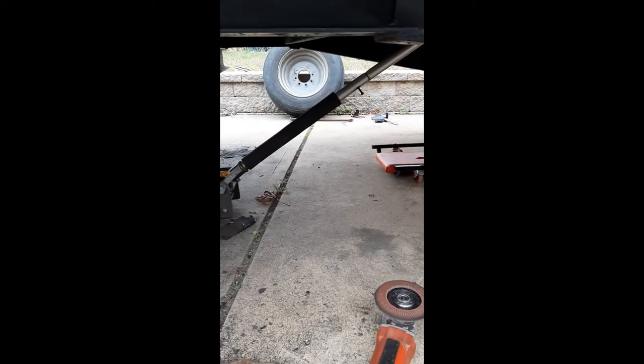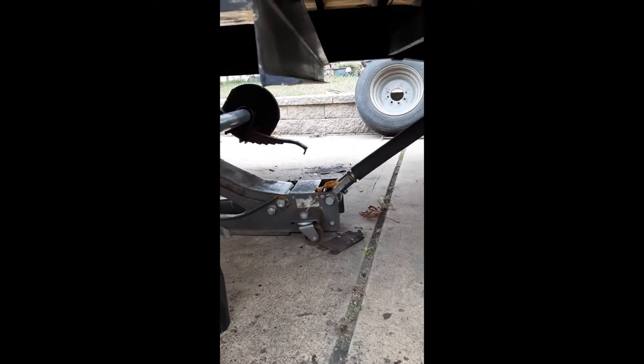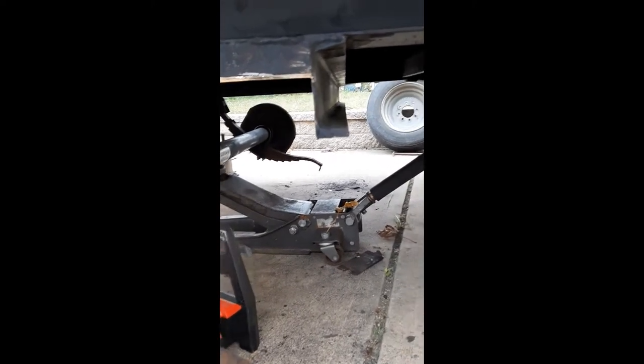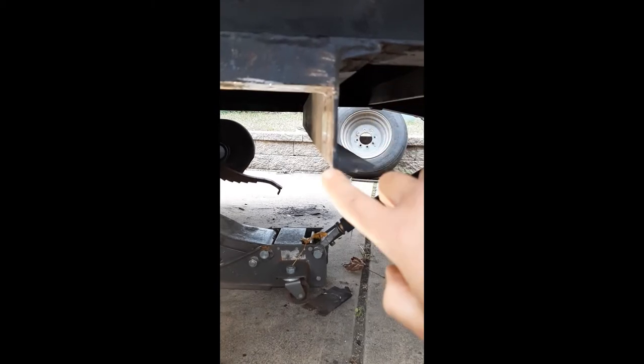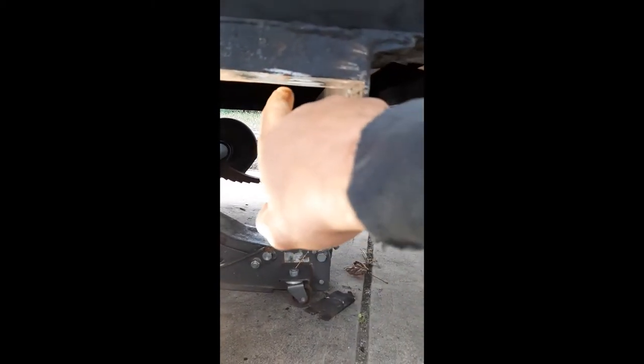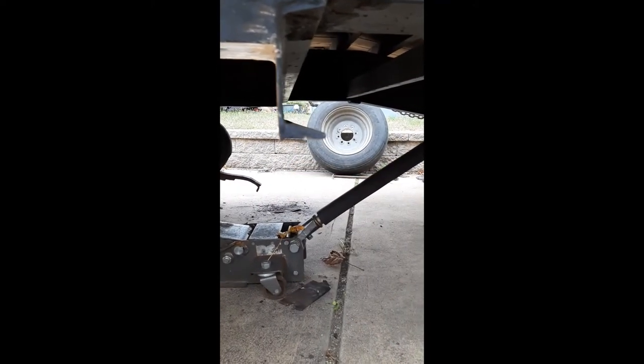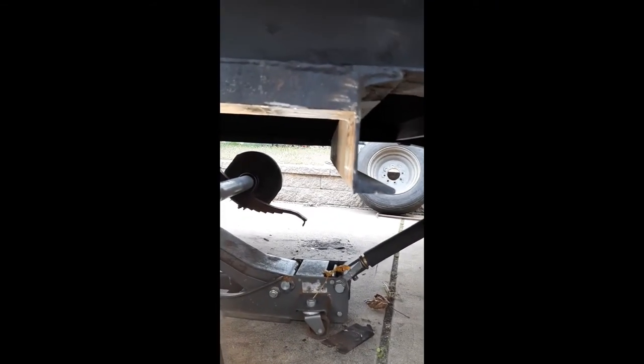Since it's not raining yet, I'm going to go ahead and get these welded on and get them tacked up. I'll get them about where they need to go, get it tacked, and then I'll do a dry fit and make sure the axles will lift back in there. I'll just jack it up and as long as they both fit in the hangers on each side, it'll be good to go and I'll fully weld it. I'm going to main weld all the way around here, across the front, back side and down — maybe weld it down here too. Then I'll tackle everything else another day.